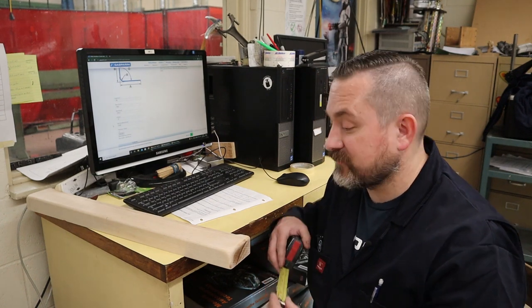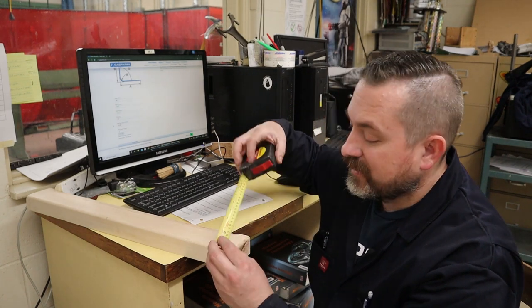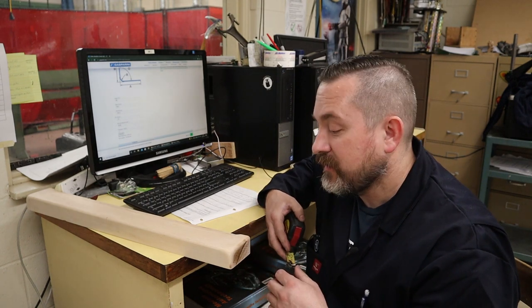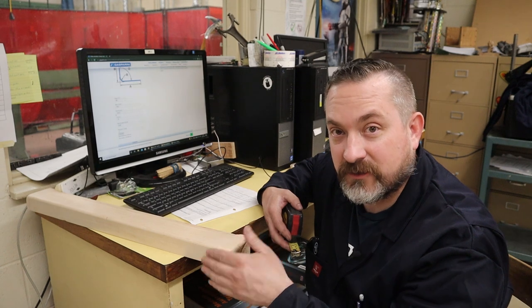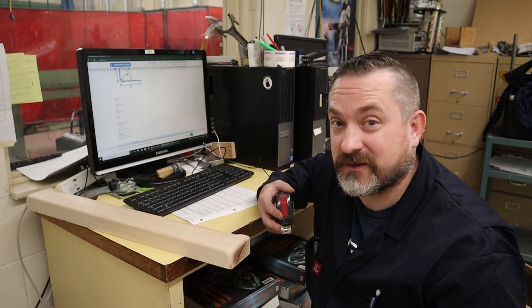So now we've got to cut our metal. In order to figure out the dimensions of the sheet metal piece that you need to cut, we've got a couple things to do. First up is measure your pieces, obviously. So this is going to be 3 inches and 1/16. And then I want 1 inch down in the actual finished part. Now that sounds like it should be just 4 1/16. However, that's a straight line measurement without figuring out any bend radius and what the metal is going to do based off its thickness and the material it is.